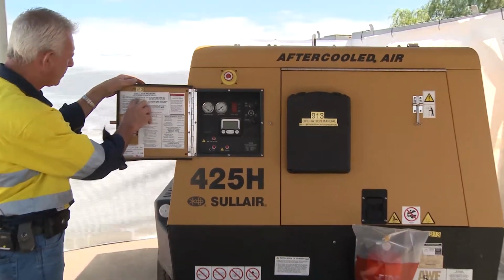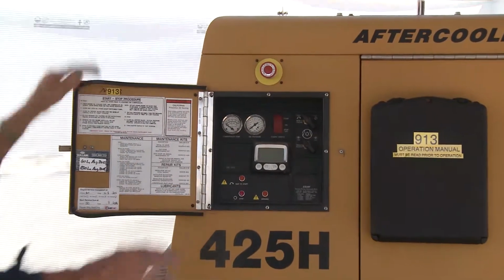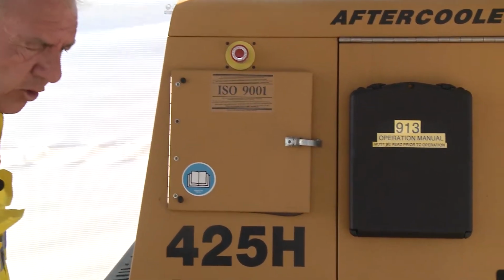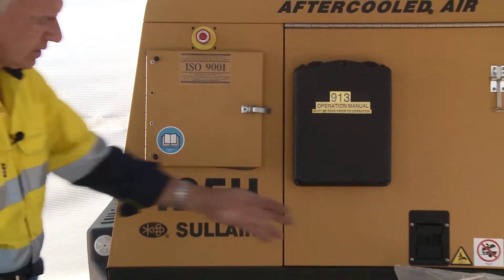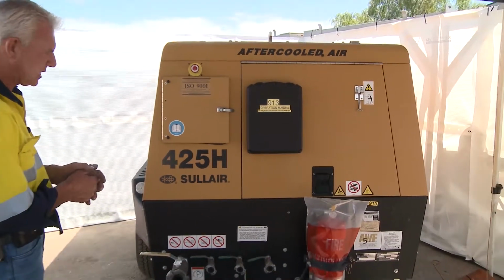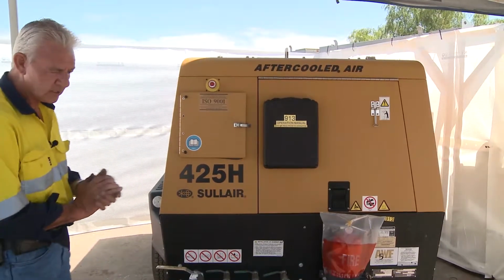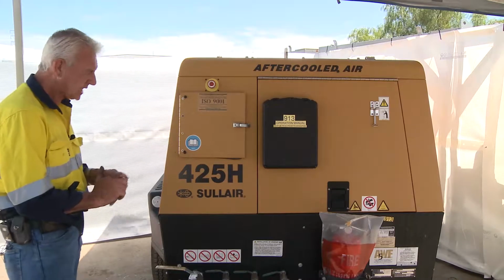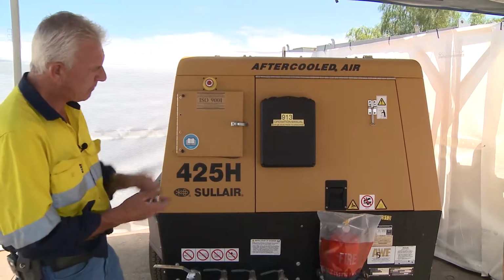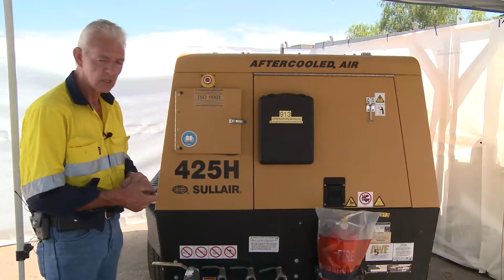As far as operating the machine is concerned, there are the fundamental requirements to start: check engine oil, coolant, fuel, compressor oil, all of those items. So just to quickly run through them for you, before I start anything, I ensure that the machine is level, the handbrake is engaged, chains and so forth are up out of the way so no one can trip on them. The machine does have a fire extinguisher, which is powder, which is indicative to the type of fire that this machine could have. If you do all the appropriate checks, you eliminate such possibilities of fires, damage, danger and so forth. To check the oil on the machine and to check the battery and functionality, you'll need to open the appropriate doors to give you access to those particular items.